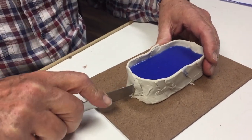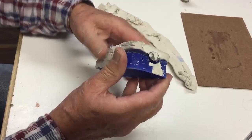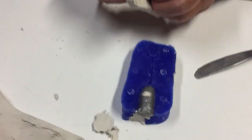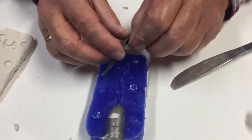After it has settled overnight, remove the plasticine all the way around carefully. Then pry open the mould — you can see the master can then be switched over to the new mould so it can create the second half.